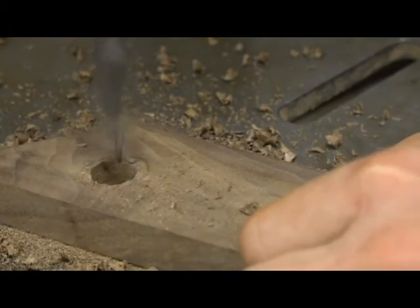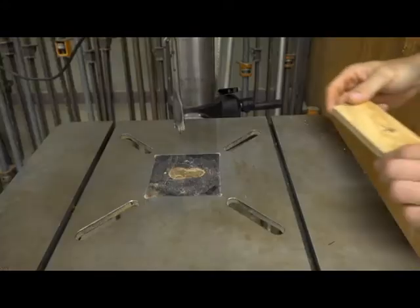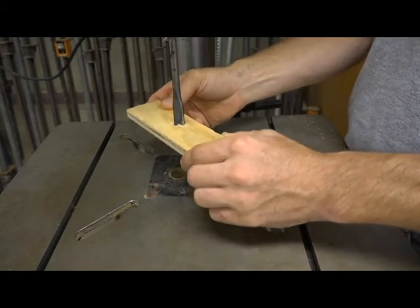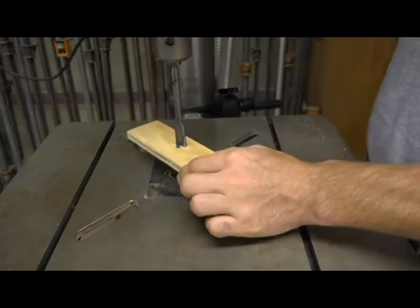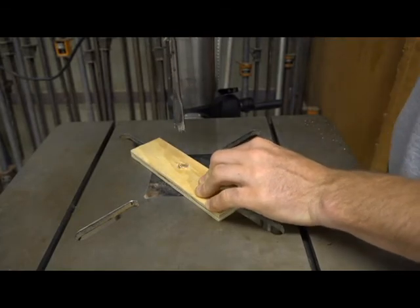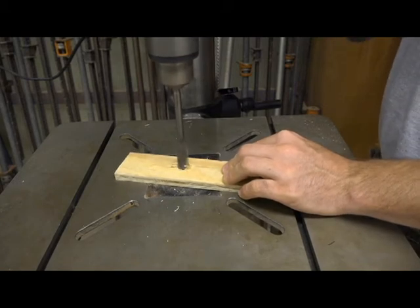If your project is not clamped and you did not drill as deep as you wanted and need to bring the drill into the hole again, it can be dangerous realigning with a spade bit. The best way to do this is to put the drill into the hole with the machine off to line it up. Hold your project firmly, then retract the bit, turn the machine on, and bring it down again. If it is too far misaligned, there can be scary results.